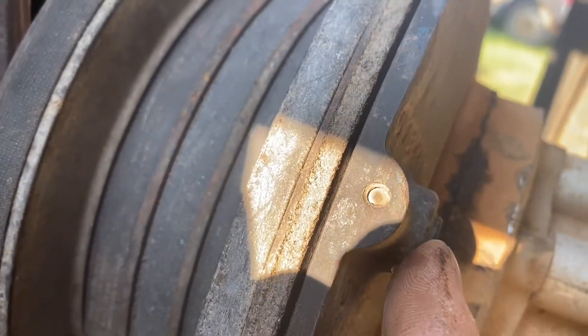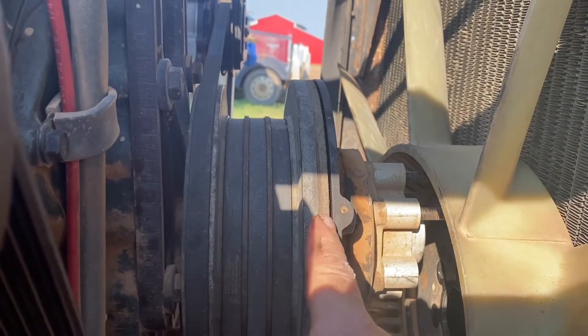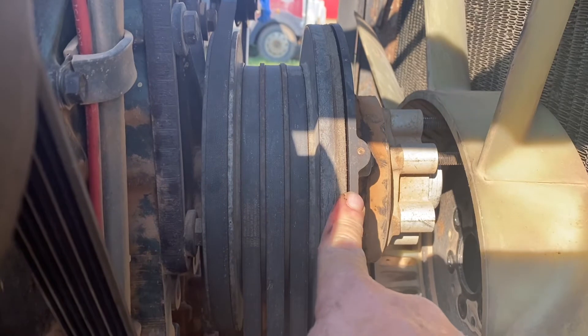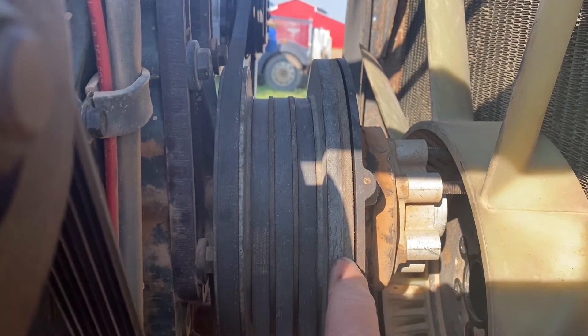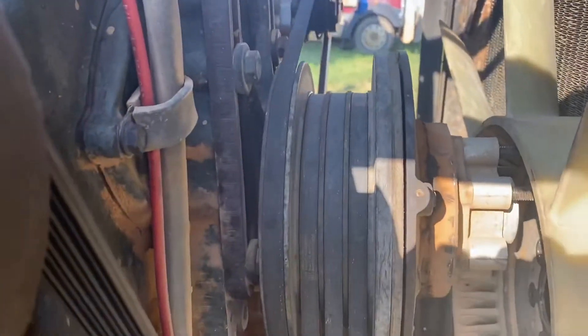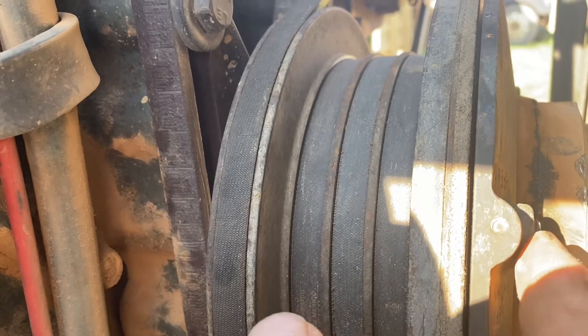There is a lock screw right here — it is an Allen. You can drive that in carefully; you don't want to overdo it. That locks the fan in place and will keep you running until you can get this all replaced and fixed. A new one is a thousand dollars with a five-hundred dollar core, so fifteen hundred dollars total. The rebuild kit is $450, so of course I'm going to rebuild it myself. When in doubt, remember you have a locking screw on the pressure plate right there — that'll get you through if you need to keep running.